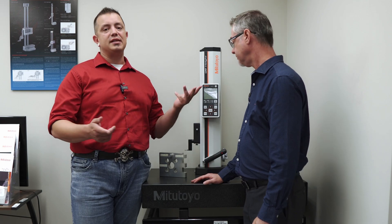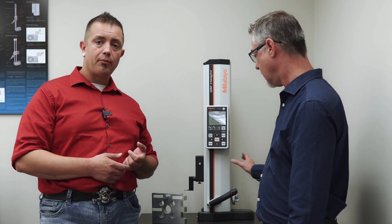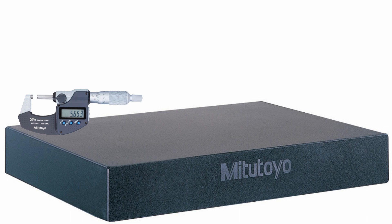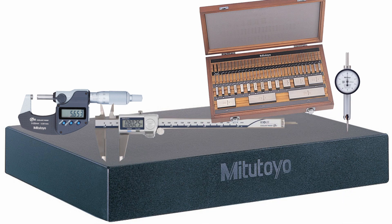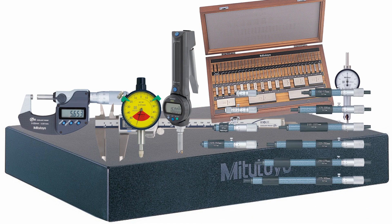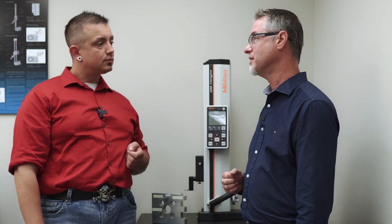Some of the people watching may be wondering: I've already got ID mics, I've already got some hole test gauges, I've already got a CMM — would they still benefit from implementing this in their shop? Absolutely. This gauge can replace a whole granite table full of tools, right from micrometers, calipers, test indicators, gauge blocks, bore gauges, dial indicators — you name it. So the one gauge at a very nice price point can replace a whole table full of tools, and it can do functions that are much quicker, like the position of a hole, which is a little trickier than just diameter.